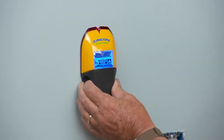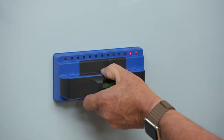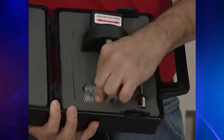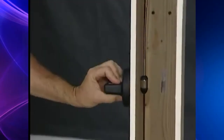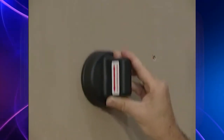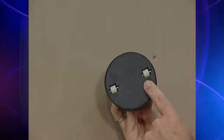One of the bonuses of using magnets is that you can look for studs. Stud finders are known for being hard on batteries, which means they're always running out at inconvenient times and needing to be recharged. So instead of letting this slow down your project, carry a strong magnet in your kit. Tie a lightweight piece of string onto your magnet and hang it along the wall you're inspecting. When the magnet responds, it means there is something ferrous behind the wall. This method also works in circumstances where the surface, material, or coating of the wall is challenging even for a fully charged stud finder.